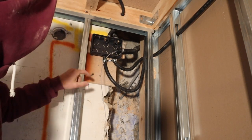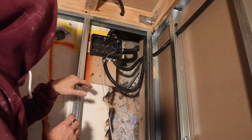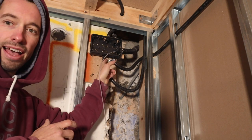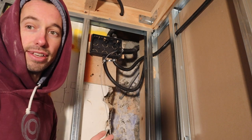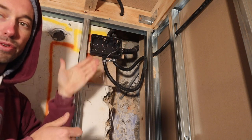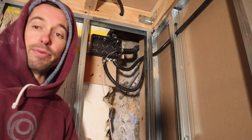It's another very cold day in the house. The aim is to finish all the main conduit today. The way I'm doing it — I've got these panels stuck on to get them to the right level for the plasterboard, but I'm using building mesh, basically looping it around and screwing it in. It's so strong, it's the best way I've found. It means even if you're pulling hard on the wires they're not going to pull out and the conduit will never fall into the wall.